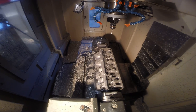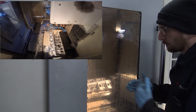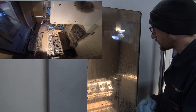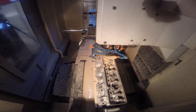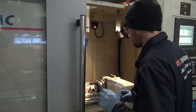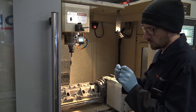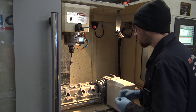The first thing it's going to do is machine down those stands that go on top of where the rocker pedestals would normally bolt to. The machine's taking a fair bit more material than is actually there, because those stands are very rough casting and they change in size from cylinder head to cylinder head. Right, that's those cleaned off. I've just left a tiny little bit standing up on the edge, only about 5 to 10 thou thick, it just broke off. I might change that section of the program to come out a little bit further next time. Now we can start the real program.